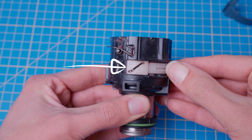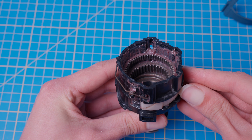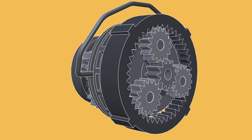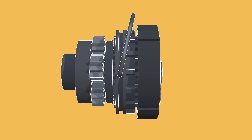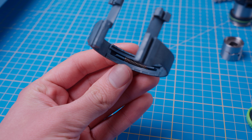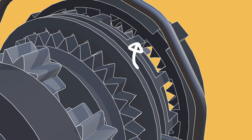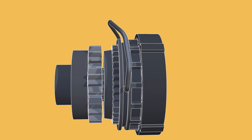The second stage is operated with a cam slot. By moving sideways you actually move another ring gear forwards or backwards. A nice detail is that these gear switches often have a spring — either the metal that holds the ring gear is a spring itself, or there's a spring built in — to make sure that even when the teeth can't mesh you can still switch gears, and then as soon as the motor starts to move it clicks into place.